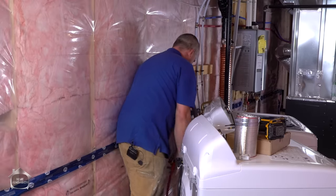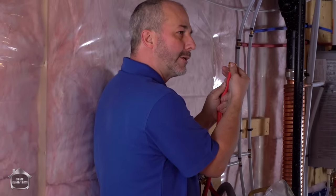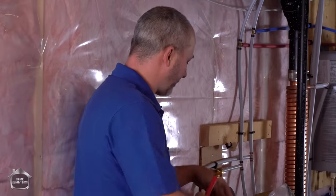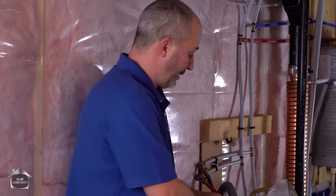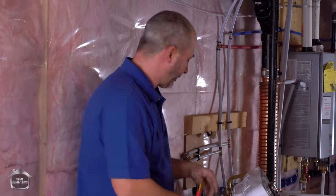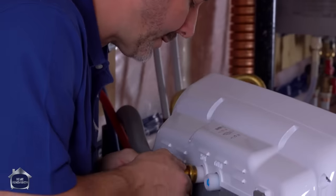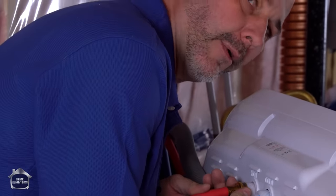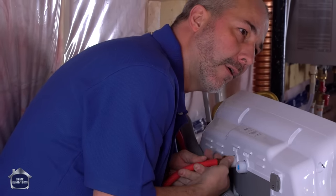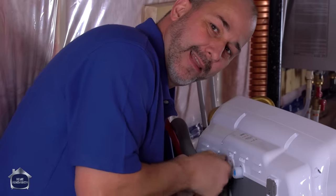Just a trick when you're working with these fittings: instead of trying to just thread it on, if you go backwards really slow you'll feel it — push and you'll feel it sit into place as soon as it grabs the thread, then you can tighten. A lot of these fittings, especially on the machine, are going to be plastic, and if you cross-thread it — meaning you go on an angle when tightening — you're going to bend all the threads over and won't be able to get a good lock. So push it up against the end and go counterclockwise while pushing with your left hand. Right there — that's where it seats in place and then you can tighten it up.